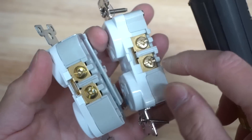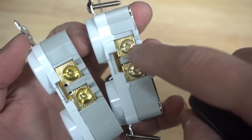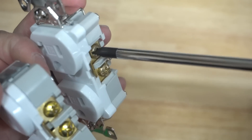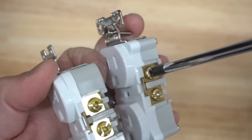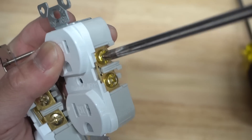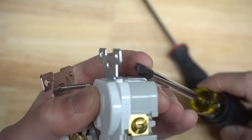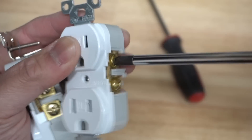The next cool genius feature: if you look at the terminal screws, notice how it looks like an X with a little square in the middle. That fits perfectly with an ECX combination square screwdriver. It gives a nice tight connection. You can use a Phillips head or flat head screwdriver, but there's a limit to how tight you can get before it slips off. With the ECX screwdriver — essentially a Robertson head combined with a flat head wing — you get that extra tightness.